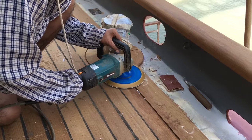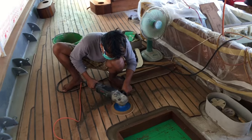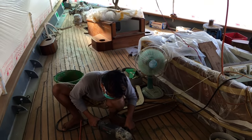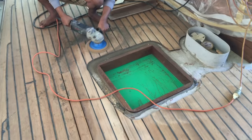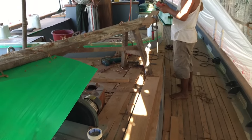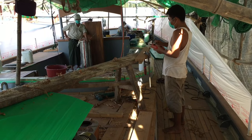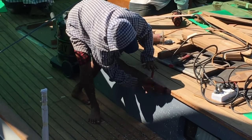With all the major slabs in place and the vast majority of the margins being put down, sanding can begin on at least the big sections. And so for days and days, a very fine grit sandpaper was used, and every square inch of the teak was sanded with an orbital sander or by hand using a good old hand plane and some elbow grease and sandpaper.